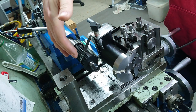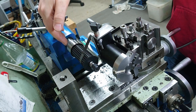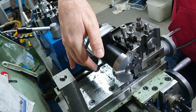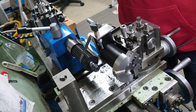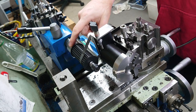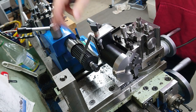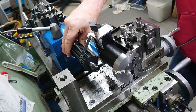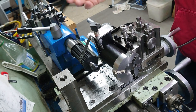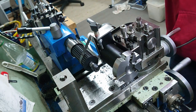I haven't modelled the collet chuck or the tailstock arbor, because they're just off-the-shelf parts. That is an ER11, 100mm long shaft, 10mm diameter, and then I've just used some bearings I had lying around. So again, no drawings for the tailstock arbor, because obviously it would potentially be different depending on what lathe you have, what bearings you have, or what shaft size you're going to use. And I haven't drawn this shaft here because this is just a plain shaft. So if you want to check out the drawings, they're in the description.